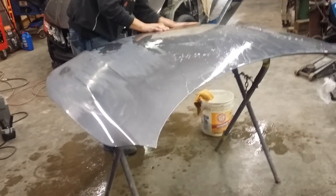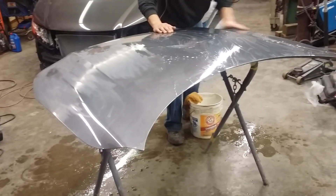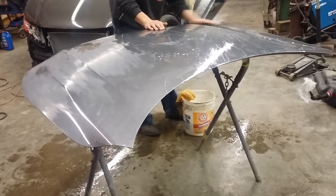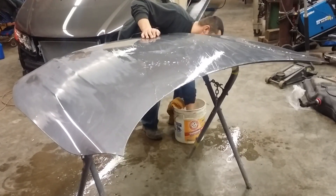If you don't have a baking system, it would be nice for a painted component to sit in a warm environment around 70 degrees for at least three days before you want to go ahead and do this.